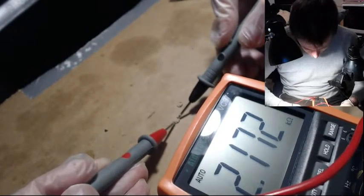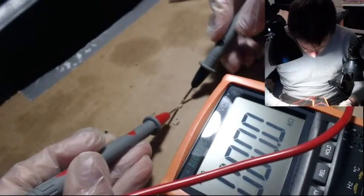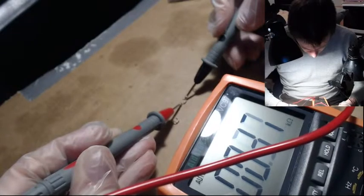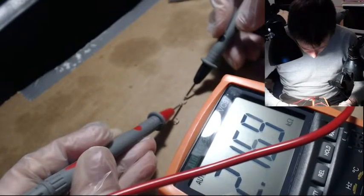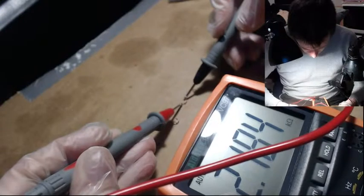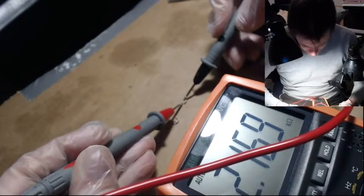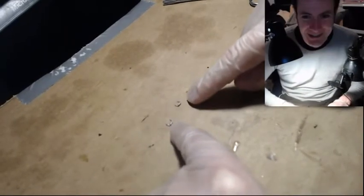2.174, 2.172. 2.168 — they're like .002 off. But that even changes depending on where I slide the pins along the shaft of the base of it. So these are 2.2K resistors.